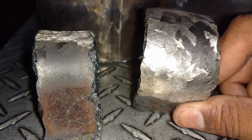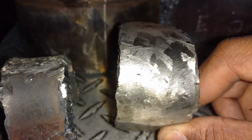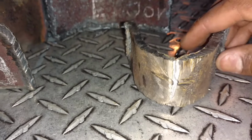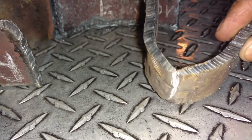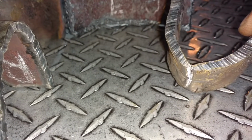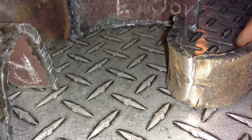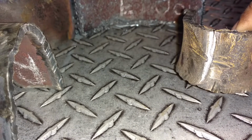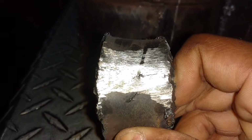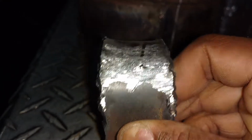So this was my cap, which actually I intended on being tested for my root. That's how I explained how this happened. This one was ground out a certain way where if it was testing my cap, it wouldn't have been an issue. But it ended up being tested for my root, and that's how the split happened. So I was able to cut another coupon and only lost 3 points for that. So all in total, got 85.